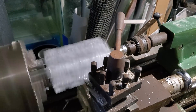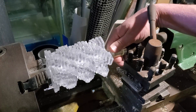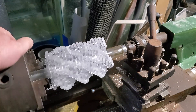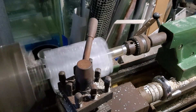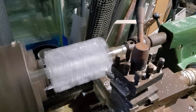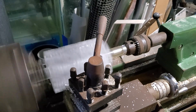The other thing I noticed as I was doing this is I was extremely cautious turning this down. It's taken a long time to get to this point — a lot of hours — and I didn't want to end up messing this up. I'm going to turn it down to a larger diameter tube first, just in case I mess up. And also, if I break off a chunk of one of these teeth it's going to be really difficult to smooth out afterwards. So I am taking off five thousandths of an inch from the radius every pass. That's a pass towards the right; the return pass I'm not taking anything off — it just smooths out little bits and pieces. Like I said, this took over an hour standing there doing this.